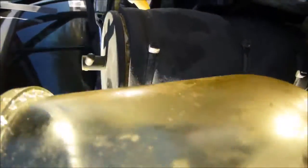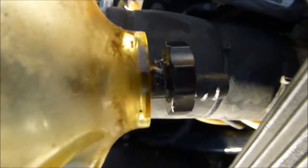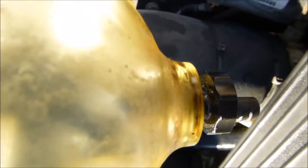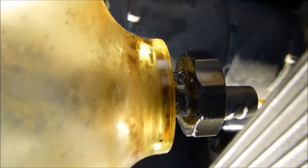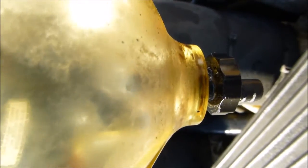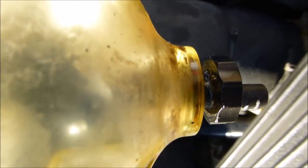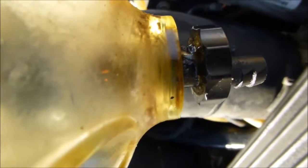We're back, and this is the clean bowl. You can notice there's no schmutz — it's a little stained up but it's nice and clear, and it's been dried off. This is that little nipple I was telling you about — that's how you drain or purge the schmutz out at the bottom of the filter, just for periodic maintenance. As you collect water from the filter it will drip down into here, and then you just drain that water off periodically.